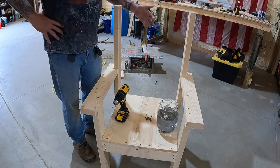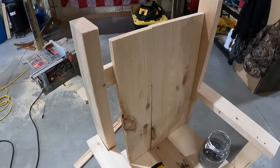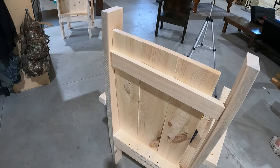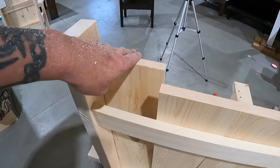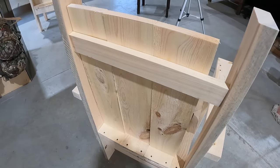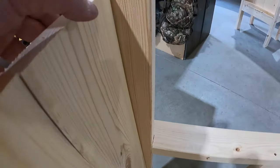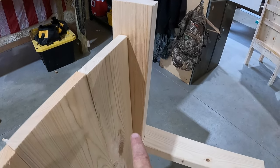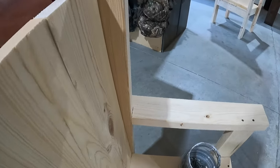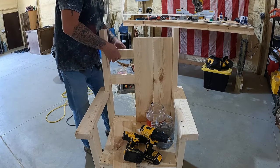Now we're going to cut the back pieces — three of them at 25 inches. Right now they're just kind of sitting there, not screwed in. I've got this piece in the back for the top back support, and I'm going to make one on the bottom too. I'm trying to make sure there's a nice line going up along the side and then coming down close to the corner — make it look as uniform as possible all the way across. The top support is in now and solid.